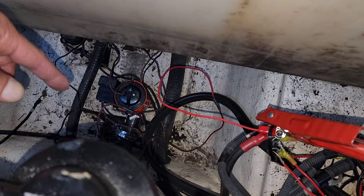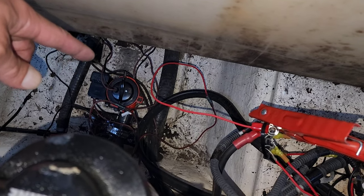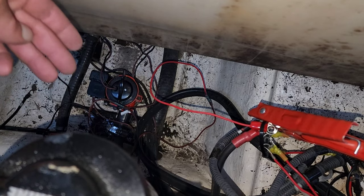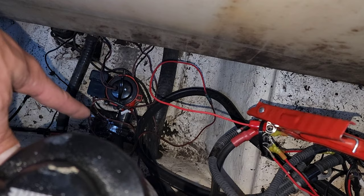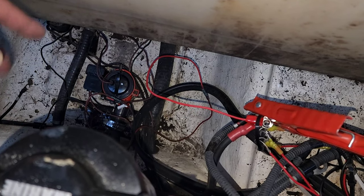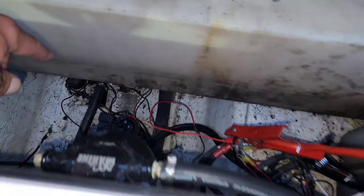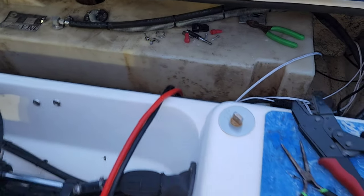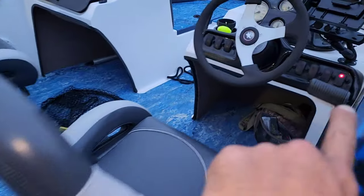If we connect this one in here and put the flip-on switch on, it's pretty simple — it's working. So what that does: that little switch is basically just like a little knob on the side of the plastic float that comes up and down vertically when water gets in here. So what happens if you leave your boat out and the rain fills it up, or if you take on a little bit too much water you weren't expecting — that thing will automatically kick on and pump it out of here.